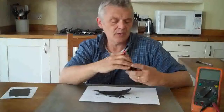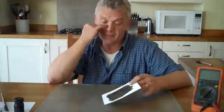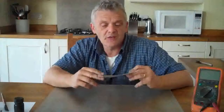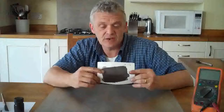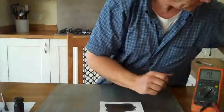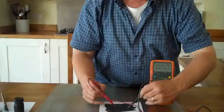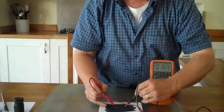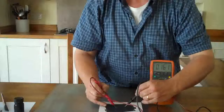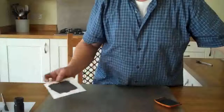Once that is dry, you can paint on the third coat, and when you test its conductivity you should get somewhere around 150 to 200 ohms — then that's going to be fine. This bit of paper has had three coats on it, and I burnished it. If you burnish it, you get a nice metallic sheen that's relatively conductive. You don't need to burnish it; you can just use it as is. And if I turn on the meter and show you that conductive reading — there you go: 161 ohms. So that's quite a nice resistivity for being able to do that.